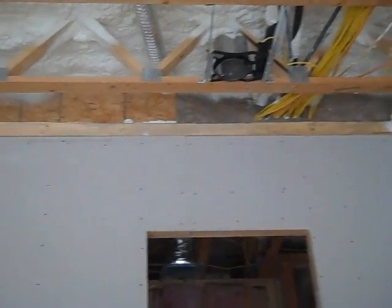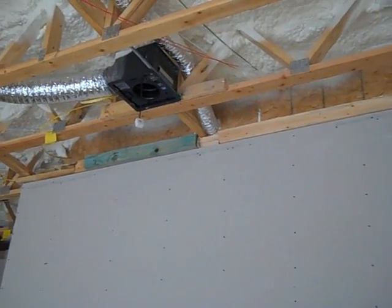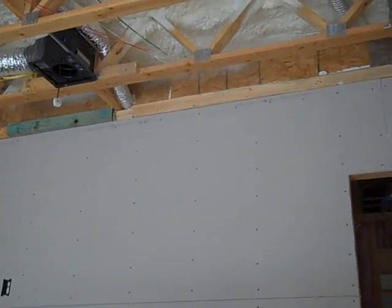Thanks for joining me everybody — we'll see you next time. Actually, one post-note: I forgot to tell you one thing I've learned over the years. The best way to spray foam in between the house and the garage is to plan for it ahead of time. That sheetrock wall there is in place as a spray foam backer, and above that you can see plywood and OSB — that's simply a spray foam backer. My trades have run wires, pipes, ventilation, and exhaust fans through there. When I first started spray foaming garages I forgot to put a backer up first — I remember spending a good 30 minutes per bay trying to fit around pipes and wires. So now I have my frame carpenters put a continuous plywood barrier up there, then we spray foam the backside.